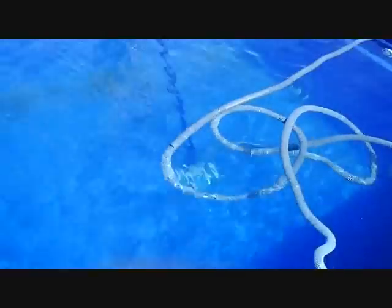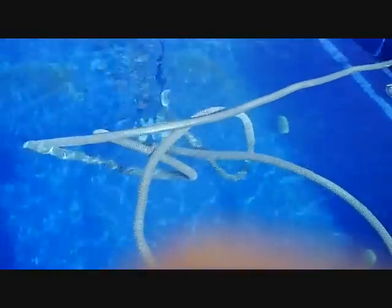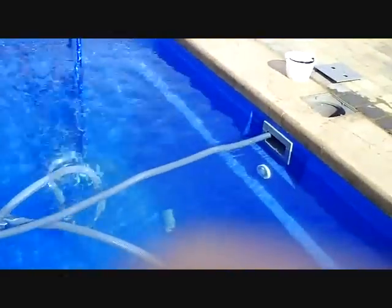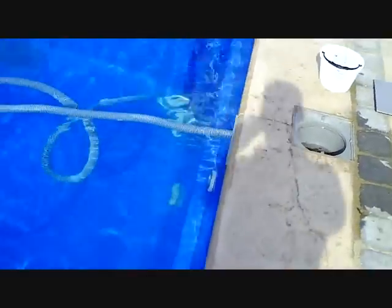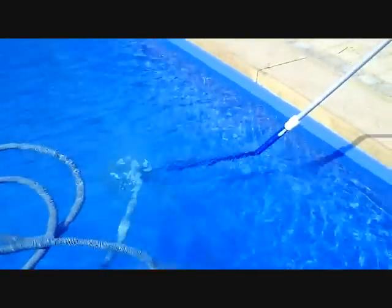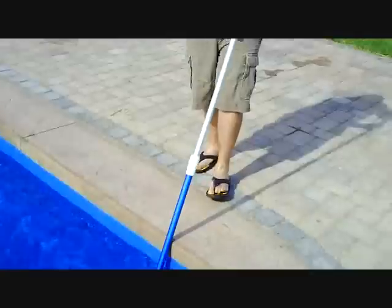When you're vacuuming a pool, it's not exactly like vacuuming a house. You do have to go a little more slowly because the debris on the bottom will get stirred up into the water if you go too fast, and it will eventually settle back out on the pool floor — defeating the purpose. As you can see, as I go over the debris on the floor, it's coming up pretty well. The most effective way to do this is to go along the edges first to get most of the debris off the edges, then focus on the floor at the center of the pool, starting at the back and going lengthwise back and forth all the way up the pool.